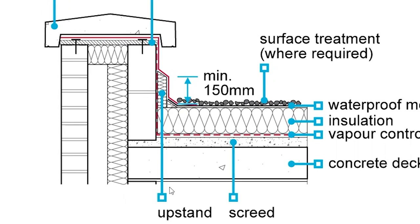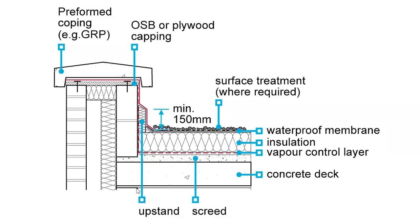Then that cold bridging effect is greatly minimized. The reason I'm talking about this mainly is because now we're closing buildings up, we're heating them, we're trying to stop the air escaping because that's the heat escaping. So there's all that airborne moisture floating around the house, and if you haven't got good extractor fans or some kind of mechanical ventilation heat recovery system, you've got all this moisture in the warm air. If it can find somewhere to condense, it will — and that little spot just at the bottom where the ceiling meets the wall is where you'll find that line of damp forming all the way along the ceiling line.